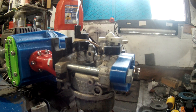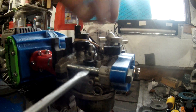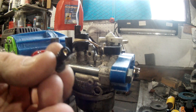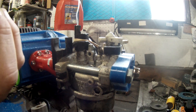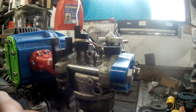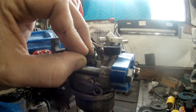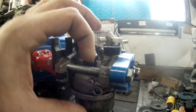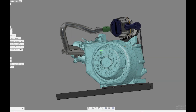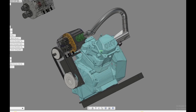From this point I have two options: I can pop the jet out and try to make it larger, or I can get a different carburetor. Watching the boost gauge jump from vacuum to boost while the throttle was open leads me to believe the carburetor is actually the biggest restriction in the system so far. This makes sense with a draw-through design — they kind of suck in this application. If I go with an average of 4 PSI, I can calculate the air difference based on engine displacement and throw in at least a 40% inefficiency, which should ballpark me at a 250cc two-stroke carb, give or take.